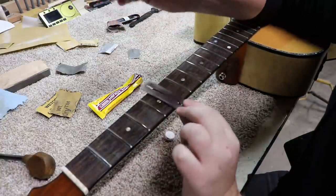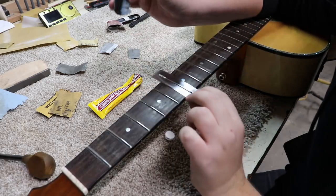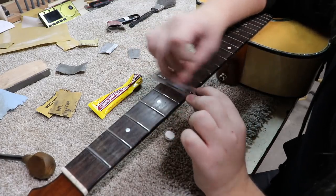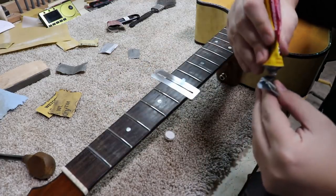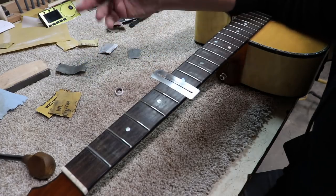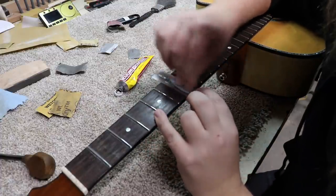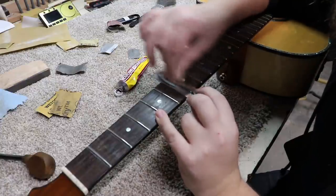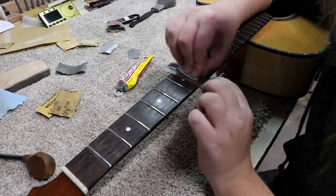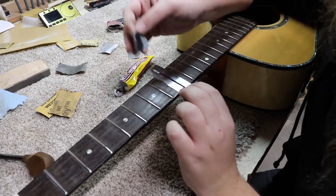The customer had asked about maybe replacing the frets on this, and it is eventually going to need it, but I don't think it's going to need it this time because these are turning out pretty good. That's a much more expensive procedure — replacing frets. You'd probably triple your bill compared to what I'm doing now, because everything I'm doing now — leveling, crowning, polishing — you have to do to new frets anyway. As well as replacing the frets, pulling the old ones and putting the new ones in is a very rough procedure; it tends to tear up the boards and we get lots of chip-out. So we'll try to level and re-crown them as much as we can before we have to re-fret them.